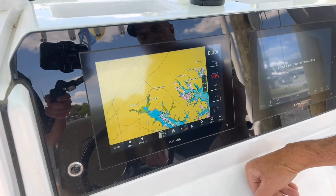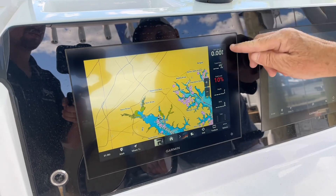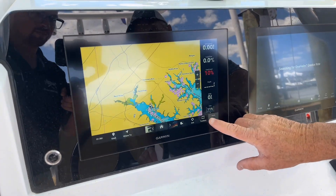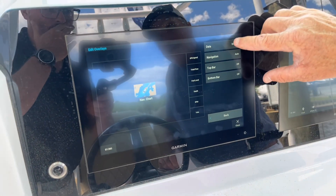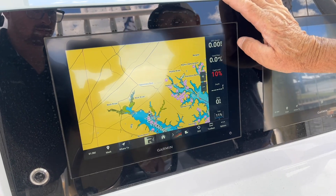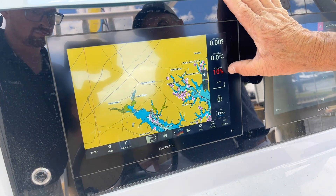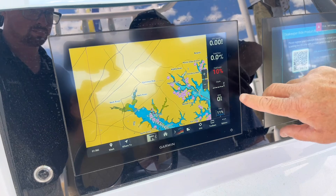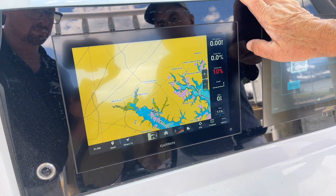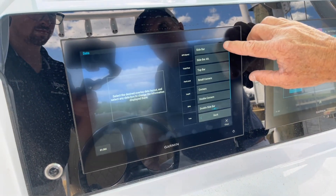First I'm going to start with your nav chart. They come from the factory with the numbers in the corners. I like them down the side panel, and to make that happen you go to Options, get the options for the screen you're on, go to Edit Overlays, go to Data, and hit Sidebar. Now all your numbers are down the sidebar. He's got GPS speed, fuel flow, fuel level at 10% — he needs to get some gas in here — depth, RPM, and engine trim. So actually that is pretty good; I'll stick with what we have there. I got to the sidebar by going to Options, editing the overlays, and hitting Data Sidebar.